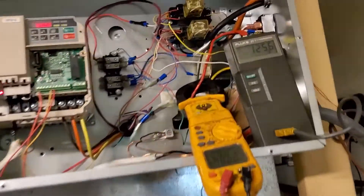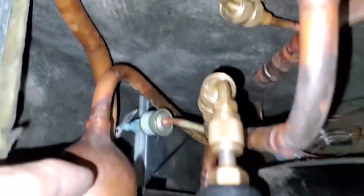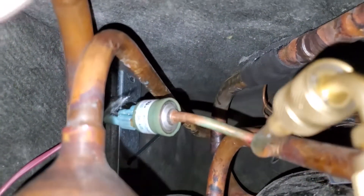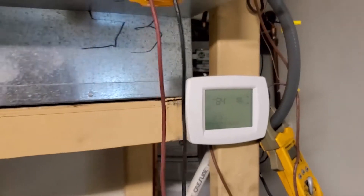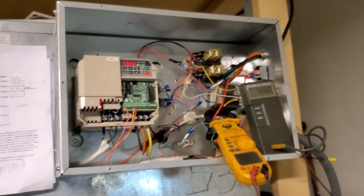Since it did stop on me, I went ahead and hooked up a safety loop — 24 volts. The high pressure switch was still installed back in there. I don't know what the exact specs are, but whatever the factory one is — it interrupts the 24-volt switch and will cut out the thermostat. When the pressure drops and cuts back in, the thermostat will do its wait thing, effectively adding short-cycle protection and all that.